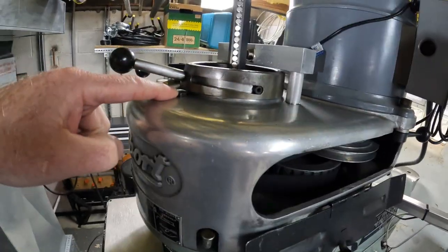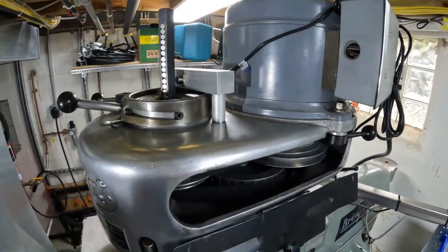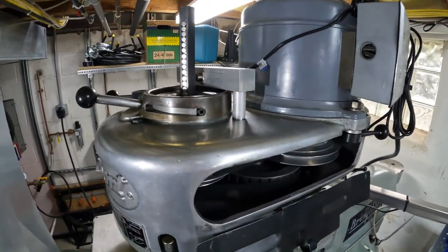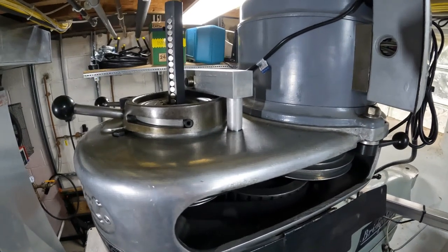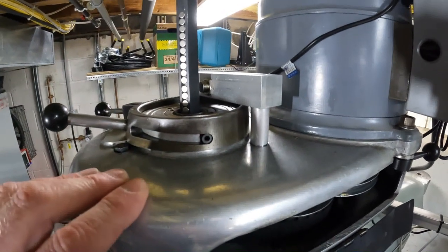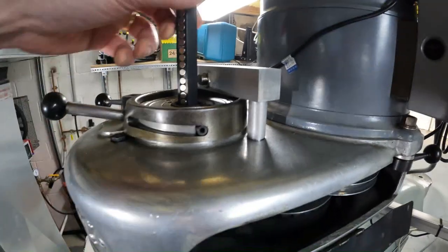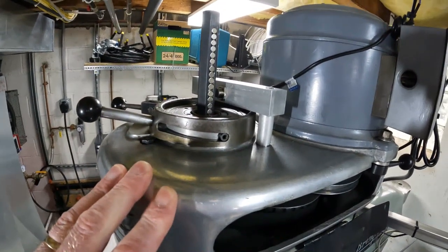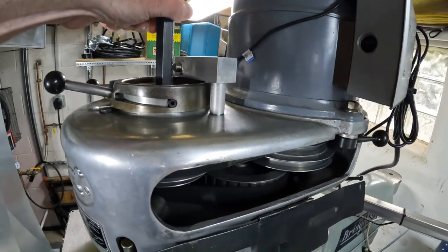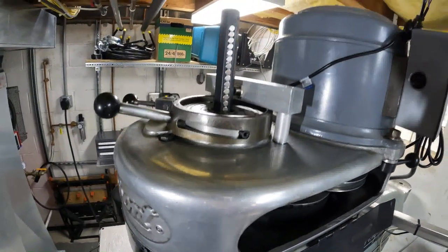There's one on the other side. I put a piece of one-inch aluminum block that I had; I threaded it — it's an M12×1 tap. You could have just drilled a hole through there and put two nuts on the end, but why not. The key to the whole thing is to put the magnets on the drawbar — the magnets go by the hall effect sensor, that's what gives you the pulse. So you have to put the magnets inside there, so I milled a slot and put them in.